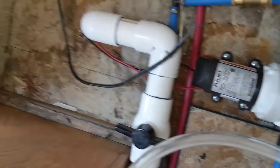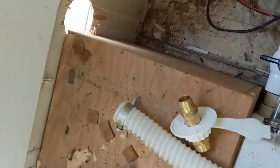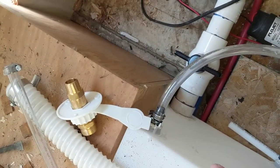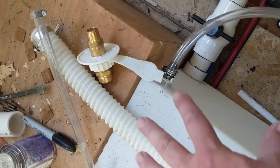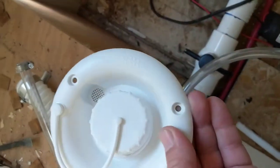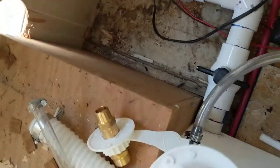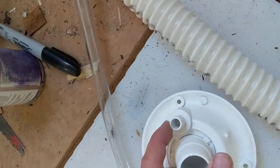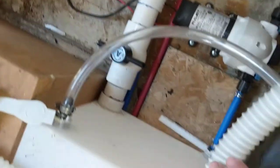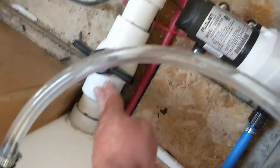So this is my inlet. This is my vent pipe — it's important that you have a vent pipe. Otherwise, as you fill it, if you've got air in there, it's just going to pressurize your tank. Here is my fill that will be outside. The vent will go to this side, the fill will go to this side, so air can go out while water comes in. Those are at the top — it's important that those are at the top. Drain, obviously, at the bottom.